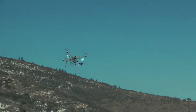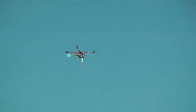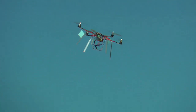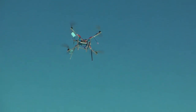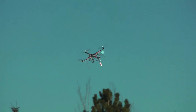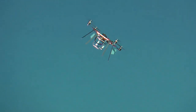I'm using the Hobby King controller board which has just gyros only — there's no accelerometers on it. If there were accelerometers then they would be trying to fight the pusher prop and hold it in the same place, but gyros just do roll axis only, so they're just trying to keep it flat on the horizontal axis and not try to keep it from going forward or backward.